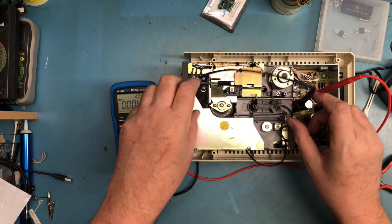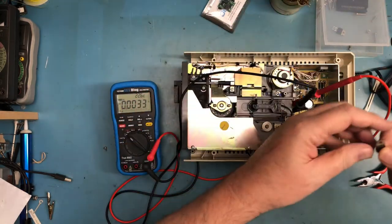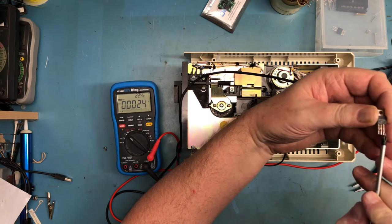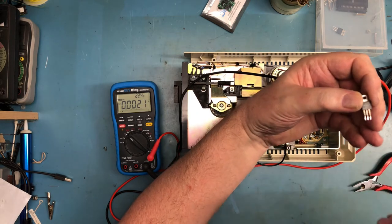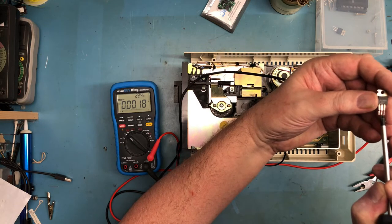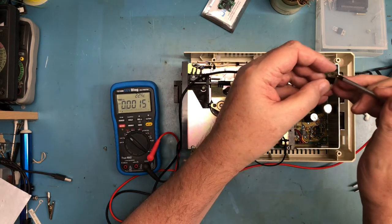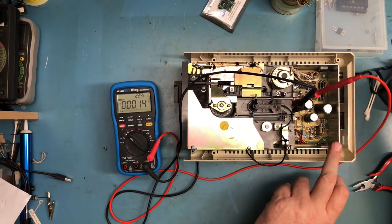because of the original voltage regulators I had in there. Just look at one, the center pin on the regulator is ground. So this is voltage in, ground and regulated voltage out on the side. That was ground, and it was soldered to the PC board on a ground, and this metal tab happens to be connected to this center pin. And the metal tab was screwed onto the heat sink, so ground was being connected through the soldered in lead to the tab, through the bolt, to the heat sink. Without either one of these in, this heat sink is no longer grounded.